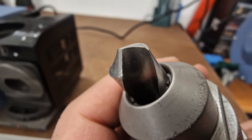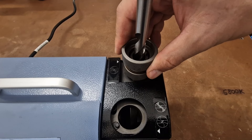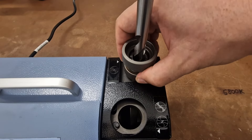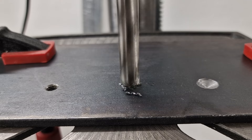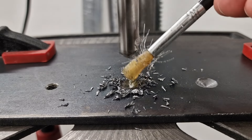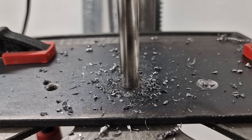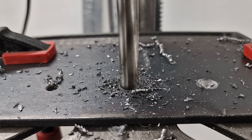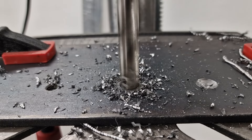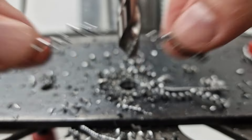As you can see, the two cutting edges are perfect and with this I could already make perfect holes. But this sharpener has a special feature — another hole that we will use to thin the web diameter. This second sharpening helps to reduce the initial cutting diameter, allowing us to drill even without a pilot hole, even if a pilot hole is always recommended. As you can see, the cut is very effective, which you can also tell by the shape of the chips that become longer and longer. The internal finish of the hole is of high quality, and if you need precision holes it's surely recommended to sharpen the bits with a professional sharpener.